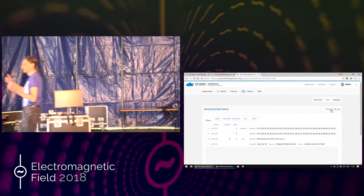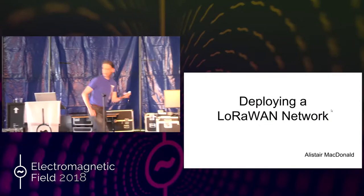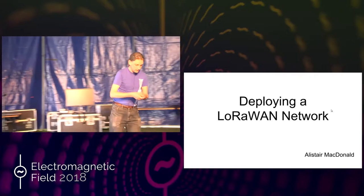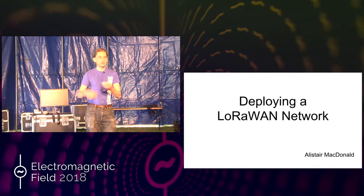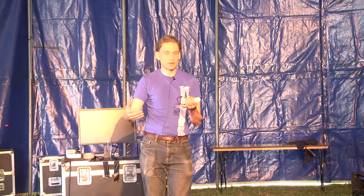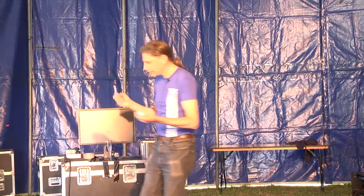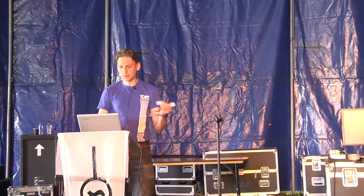It's part of an LPWAN, low power wide area network, and it's basically for connecting internet of things together. There's other versions as well. I'm going to try and speed through this. We've got time for questions, so if you want to know about other options, but this is a free and an open one to use. Semtech is a company who's developed some of the technology involved, and they lease it out. But most of the infrastructure that we're using is open source. In fact, LoRa is the encoding, is the technology, and LoRaWAN is a system that moves things around the world.